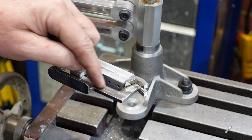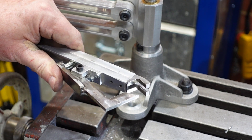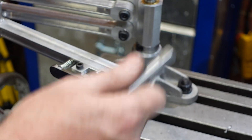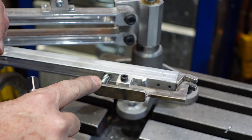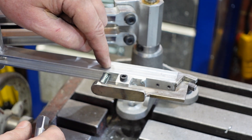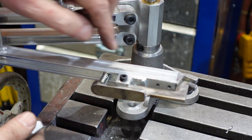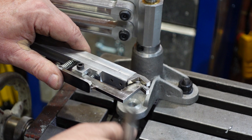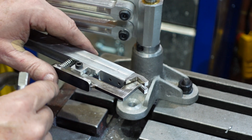This is the final piece — I've welded a piece of flat on there and I've got a spring in here with a pivot. The idea is I can push that and take a tap in and out, because I want to be able to start a tap and then remove this to be able to get further depth. This is really a try-it-and-see solution. The other possibility was tapping a thread in the web of this beam and running a screw through to hold it. It's going to be a bit of trial and error. The movement between an M3 tap and an M16 is only about 5mm or so, so a stiff spring would do that quite nicely.